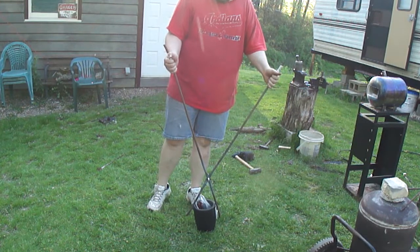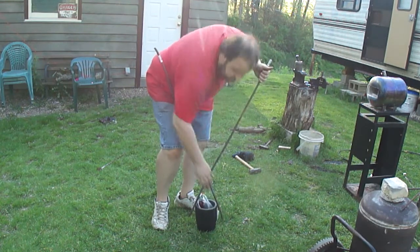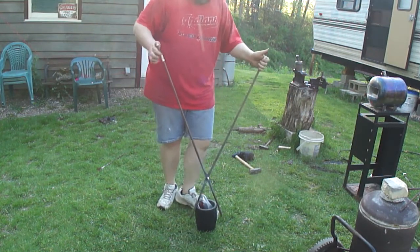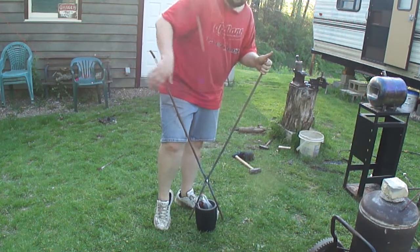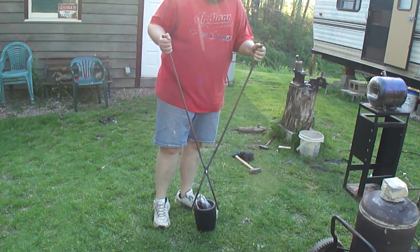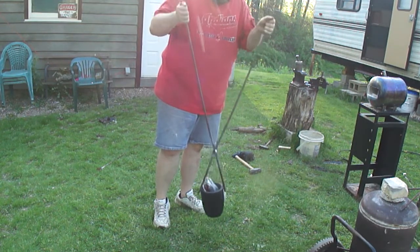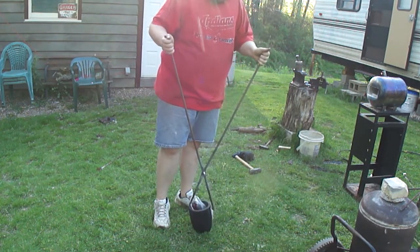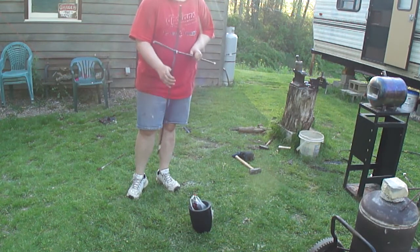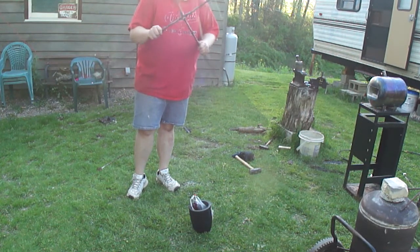I should make the tongs for these. Pretty simple. I'll just bend them over so they match the profile on the sides, just one plate at the top. Then bend these back a little bit so they go straight up, just like my other tongs did. That way it's a lot more comfortable for me. Partway done. I'll make a rivet to go in here when I get everything bent up. But for now, this is fine as is.